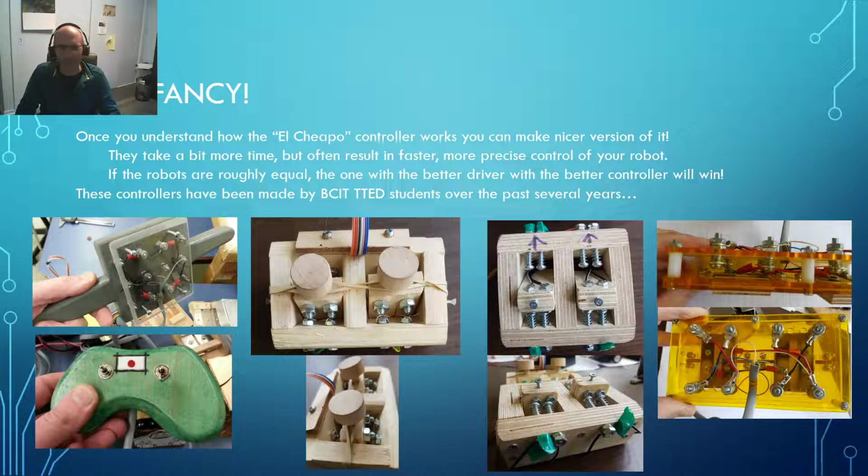And what you'll see that's really common between this design, where you've got little pieces of wire bent right in here to make the contact and springs sitting right in here to make the contact, is that the springs allow for this contact and this contact to connect at different times more easily, because if your tolerances are slightly off or things are bent slightly, you'll have one contact hit before the other. If your thumb's not right in the middle of that piece of wood on the inexpensive H bridge, anyway, the springs just allow for a little more tolerance on your metallic contacts.